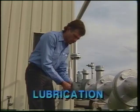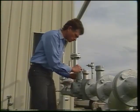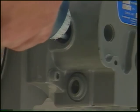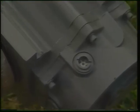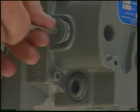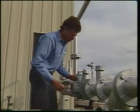With the gear end open, fill the end reservoir with lubricant. Add oil into the reservoir until the level comes up to the center of the sight gauge. While this meter is installed horizontally, another sight gauge indicates the oil level on vertical installations. Next, replace the plug. Plugs must be set tightly to 5 to 10 foot-pounds of torque because the meter end reservoirs are pressurized during operation.